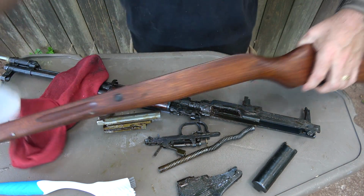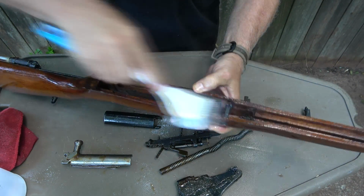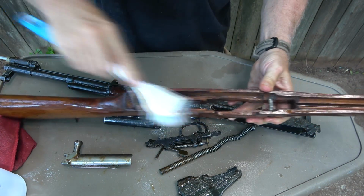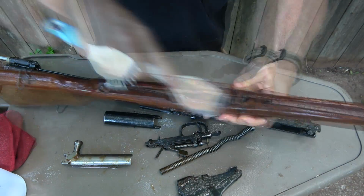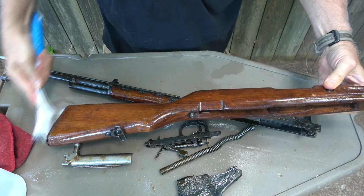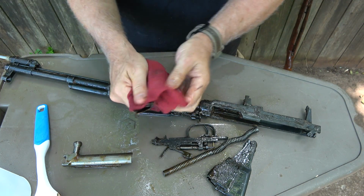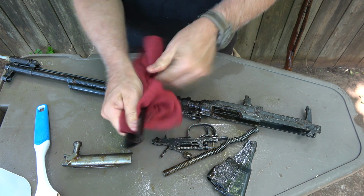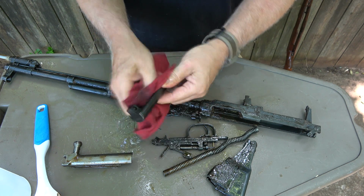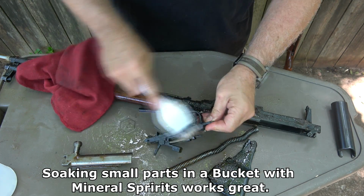And one thing I'm going to do is to soak this. Of course, I can take my brush, get in here and just wipe it down, get it good, just scrub it. Scrub it, baby. That Cosmoline is going to get down into all those fibers. Some of these parts are going to be easier. We get the dust cover. It's a pretty simple part. Yeah, I highly recommend wearing gloves. I was just too lazy to go get them. And this brush really comes in handy for these more complicated parts.